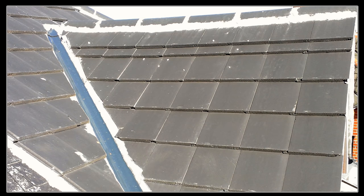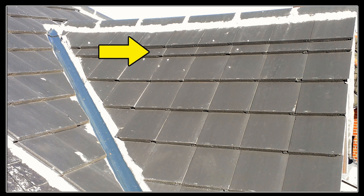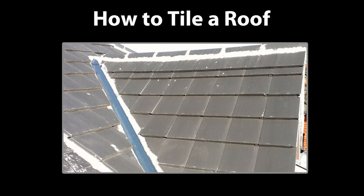If you set out the roof wrong, the tiles can be too stretched in one section causing it to leak, and the stretching can become so bad that an extra row of tiles gets shoved in. You would be amazed — and I know I still am — how many roofers and builders fall into this trap. So let's not follow them.